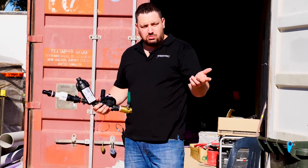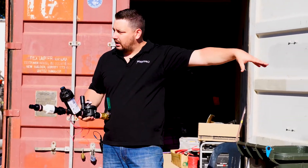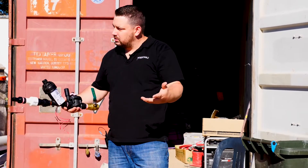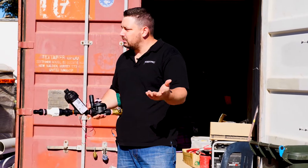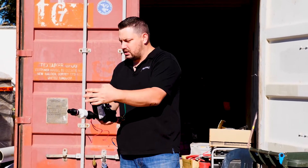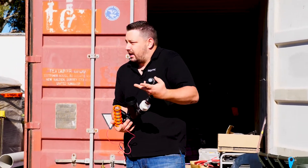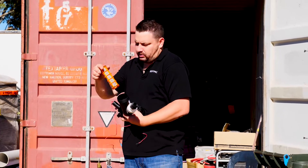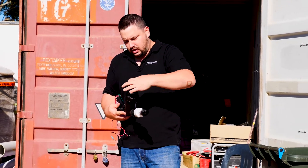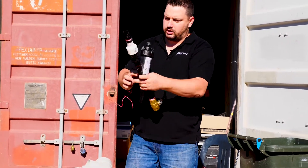All of what you guys are installing is eventually going to be handed over to the City of Port Adelaide Enfield, so they'll be left with what you've installed. This should have a 20 to 25 year minimum lifespan. If the filters ever get damaged, you can buy the screen as a replacement, and the rest of the housing is all polyethylene — so providing it hasn't cracked, it'll still be fine to use.